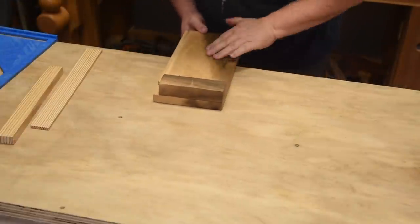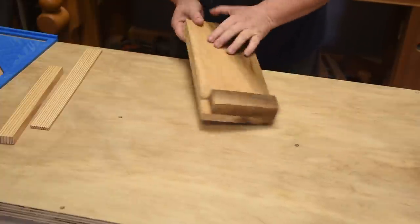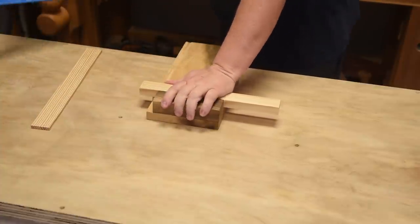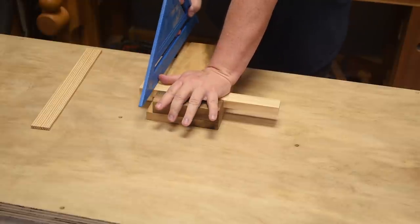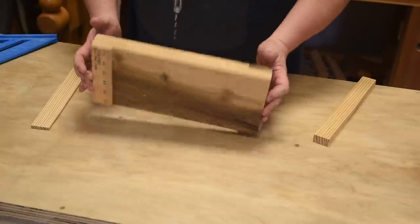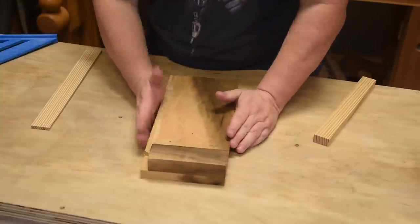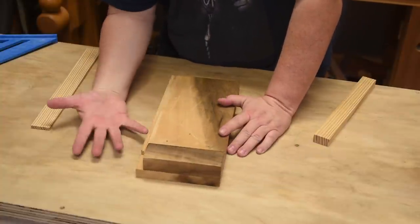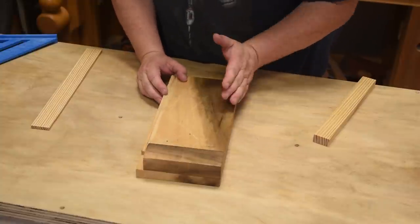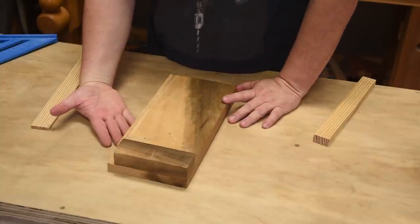The purpose of a bench hook is to give you something to bump up against. You have a piece of wood on the bottom that registers against the bench edge, and something to push against on top, so you can lean against it to saw safely. The key is that these two braces have to be parallel — and ideally perpendicular to the side you do your cutting on. I'm right-handed, so the perpendicular side is on this side. If you're left-handed, yours is the other side.